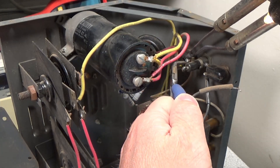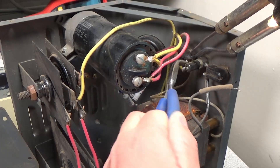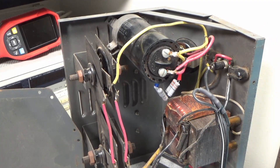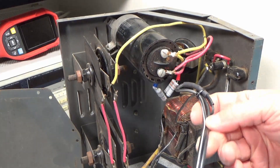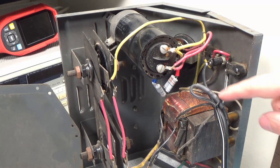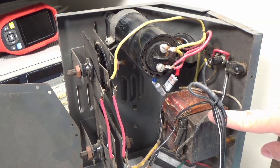The way this was set up before, the AC line was fused on one side and switched on the other, and it had a non-polarized plug as I showed earlier. The new setup is such that the hot side of the incoming AC power is fed into the fuse first, then through the switch, then finally to the transformer. This way, if a fault does occur, the unit can only be at neutral potential.